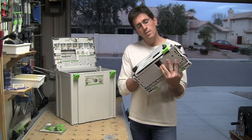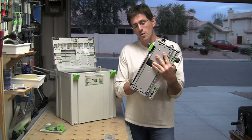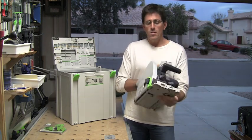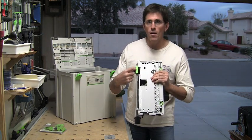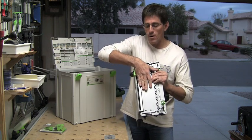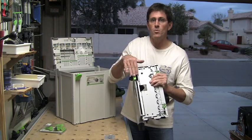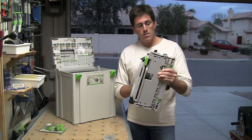When you plunge the saw, it's going to cut through that guide. This is actually a brand new one, so you don't see the cut in there. It will cut through this piece of plastic. Then, when you're running the saw and making the cut, you're going to have support on the off-cut side of the blade as well — the keeper side is sitting on the guide rail and that's going to have its own splinter guard. So, you're going to be protecting from splinters on both sides of the cut, and with that you can make some very, very clean cuts.